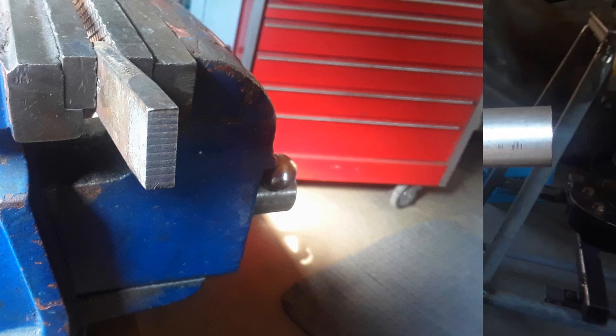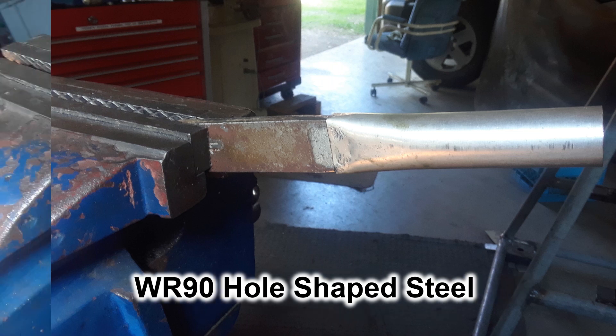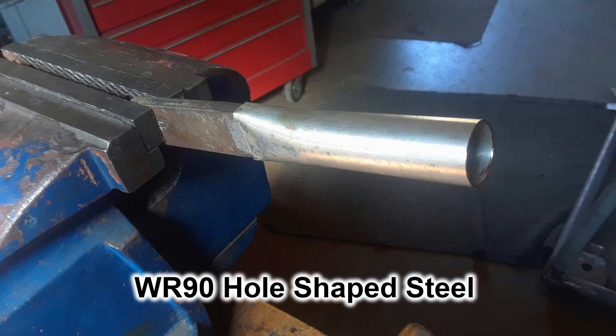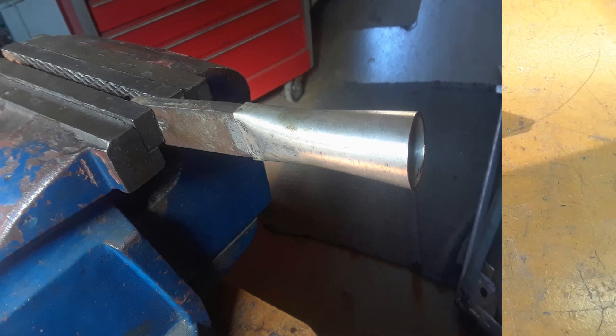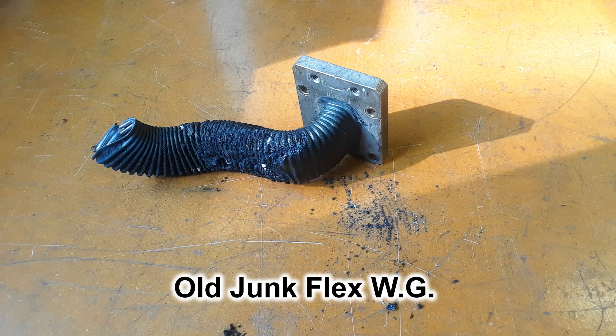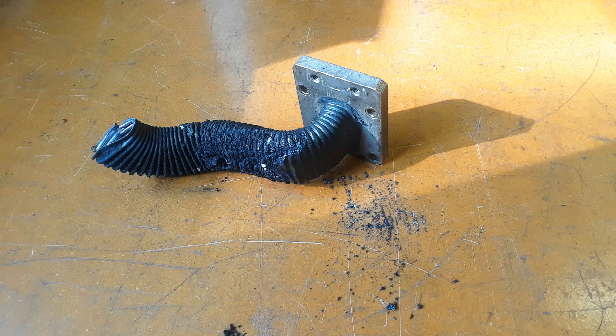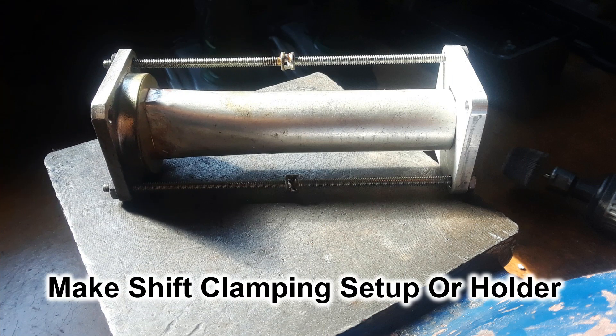To accomplish the round-to-rectangular transition, I took a piece of steel, ground it down to the shape of the waveguide hole, then worked the pipe with pliers and the vise, and lightly tapped it to make the end a rectangular shape. Next I needed a WR90 flange — I ripped the end off one I had; tried heating it but that didn't work, so it was just a matter of cutting it off. It had to be made of metal I could solder to. I had lots of aluminum ones laying around, but solder doesn't stick to aluminum very well. The next trick was figuring out how to hold everything together so I could solder it.